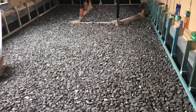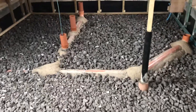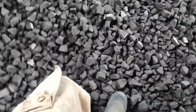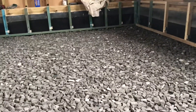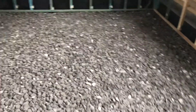I've compacted this end. If I go and tread on the uncompacted bit, you can hear the difference. The uncompacted is sinking like a ball pond, and the compacted is all nice and flat. It's probably gone down about an inch, maybe a bit less — I've got 10 inches in there and it's gone down maybe half an inch to an inch, but it's all locked in nice and tightly.